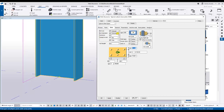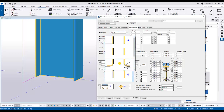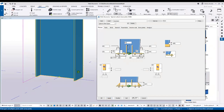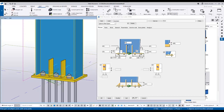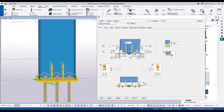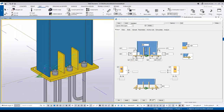I have two rows at 150mm spacing and 75mm as the edge distance of the bolt. I'm not going to put anything on both sides because I'm going to use anchor rods instead. From the requirement I put 25mm, and for the base plate with anchor rod I simply choose this type of anchor rod and add a nut and washer. I apply and then pick the column, then pick the position at the bottom of the column. We now have the base plate with the stiffener.